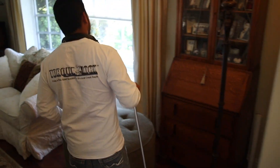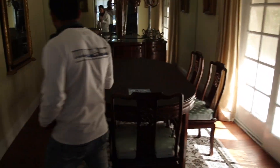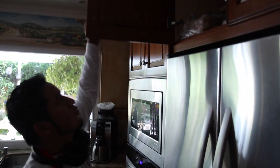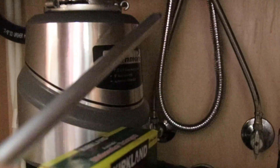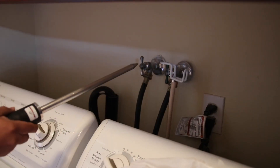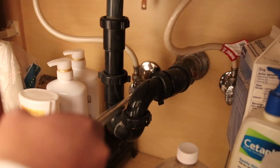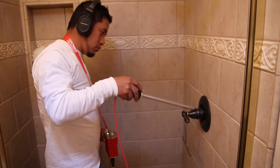We're not going to stop there — we're always going to back ourselves up. We're walking the rest of the house, looking at what it's made of, always looking for plumbing, wet bars, bathrooms, whatever might have stub ups. We listen to the cold and hot water side underneath the sink, stub ups on the washer dryer, under bathroom sinks, angle stops by toilets, and by shower valves. We actually listen to the screw that goes right through the body of the valve.